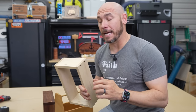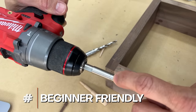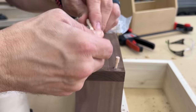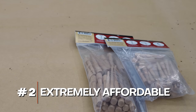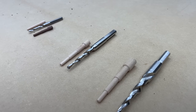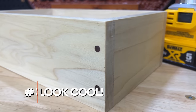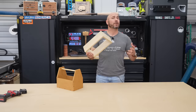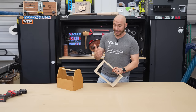Three things I love about the Miller dowels. Number one, they're extremely beginner friendly — if you've never tried dowel joinery, this is a good way to start because you don't need a special dowel jig that costs a couple hundred dollars. All you do is take their drill bit and drill through there. Second, the whole kit is extremely affordable — you get a really nice, unique dowel joint that's very strong and super easy to do. And number three, they just look cool. This is a great way to add contrasting joinery to a project that would otherwise be kind of boring, and it's very strong.